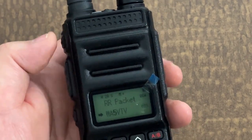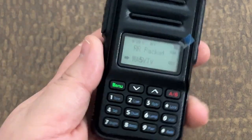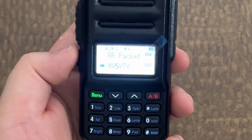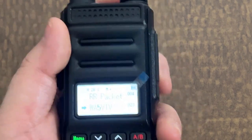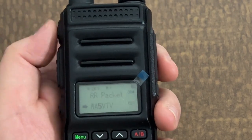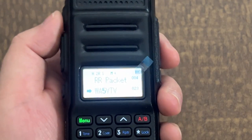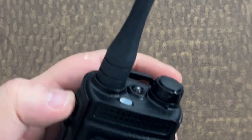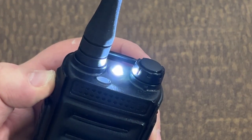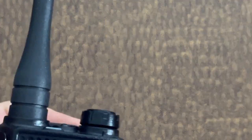One of the things I like is these buttons — there are two buttons on the side, a lower button and an upper button. They're not programmable, unfortunately, but they do something really good. The bottom button puts you straight into full monitor mode, so if you need to monitor something or you're trying to reach a contact far away, press that button and you go into full monitor mode. The button up top — if you're in the nighttime, push it and it brings on your backlight. Double press it and you get your flashlight, which is quite usable, about the same as the Baofengs. If you just push and hold it, your lamp will come on, and when you let go it goes off — so if you need momentary light, it lets you look around without wasting the battery.